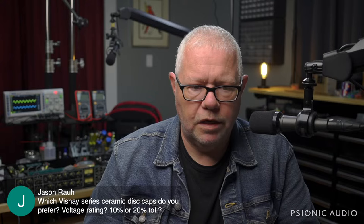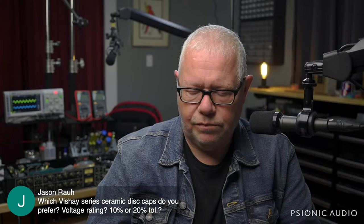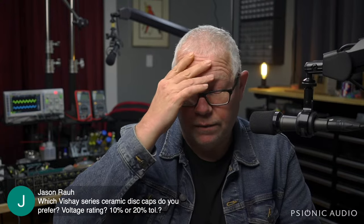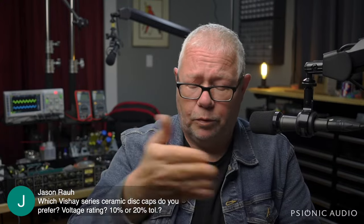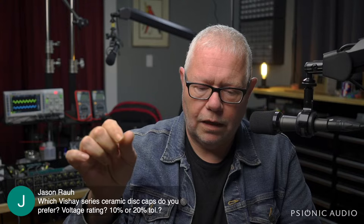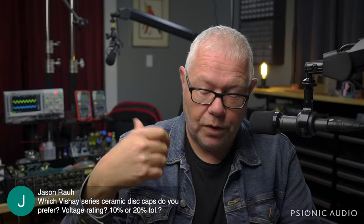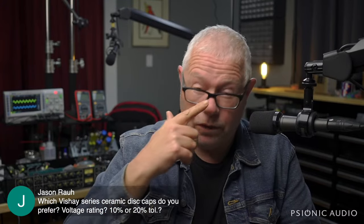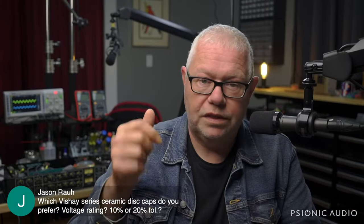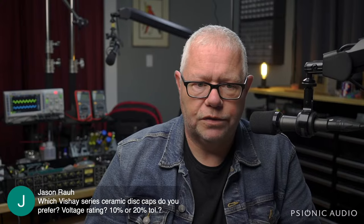You know, I was tuning a Moog Prodigy yesterday, calibrating it. And it was interesting because that's an actual pitch thing, where I'd be targeting, say, 394.7 hertz. I don't remember what it was. That was the goal. The trim pots were very sensitive and it's really easy to overshoot. I had it hooked up to my meter so I could see the actual frequency coming out. But I could hear when it was 2/10 of a hertz flat or 3/10 of a hertz sharp. That doesn't apply when it comes to small value cap values like this.